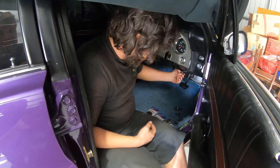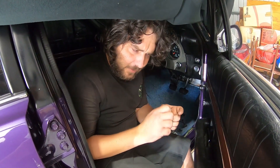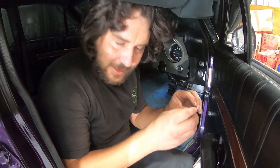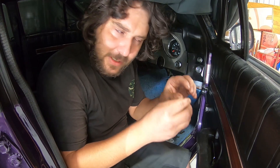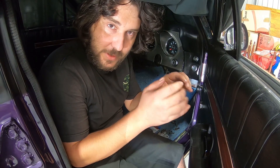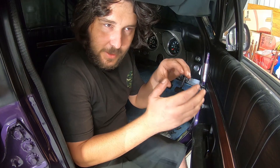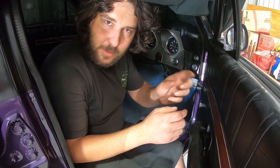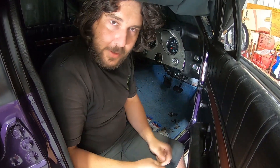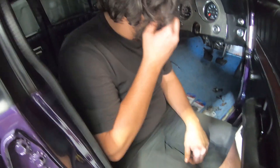It was a little bit difficult — we had to persevere. We had to muck around because all the hardware was missing from the linkages; we had to improvise and make up all the washers and spacers. Walking around with the selector tags on the box — they seem a bit notchy. Dirt can get stuck in behind them and make them stiff, or if someone's had the box apart and there's no spring washer under the nut, the selective mechanism won't work inside the box. Those tags need a spring washer, done up tight.